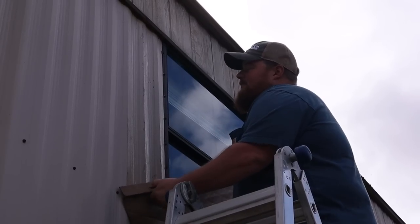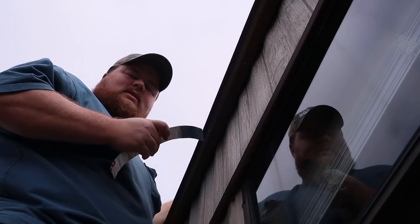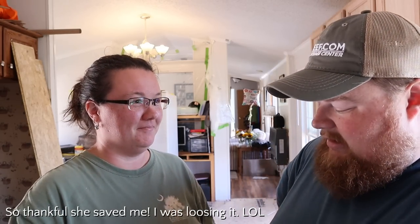The one we get on camera strips out — amateur. We've got to this window... so we found out the thickness of the joist differences and ripped a scrap piece of wood to this thickness to come back and shim up that joist. We figured out the original issue. You said that a lot smoother than me on those previous tries. I'm going to look taller because I'm on wood. That's fine, you can be tall — I'm too tired to be taller.